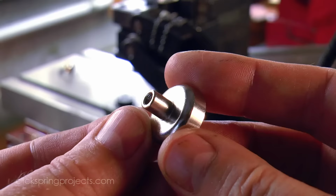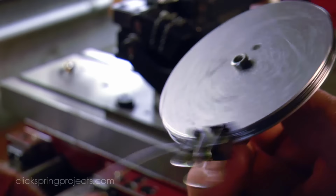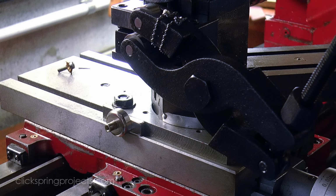While prototyping this process, I used a couple of permanent magnets to provide support for the spool as it feeds the wire into the roller tool to get an idea of where the bearing should best be placed before committing to making any supporting parts. Now that initial idea ended up working well enough that I've kept using it for now, but it wouldn't take much to make this arrangement a little more robust in future if it should need to be so.